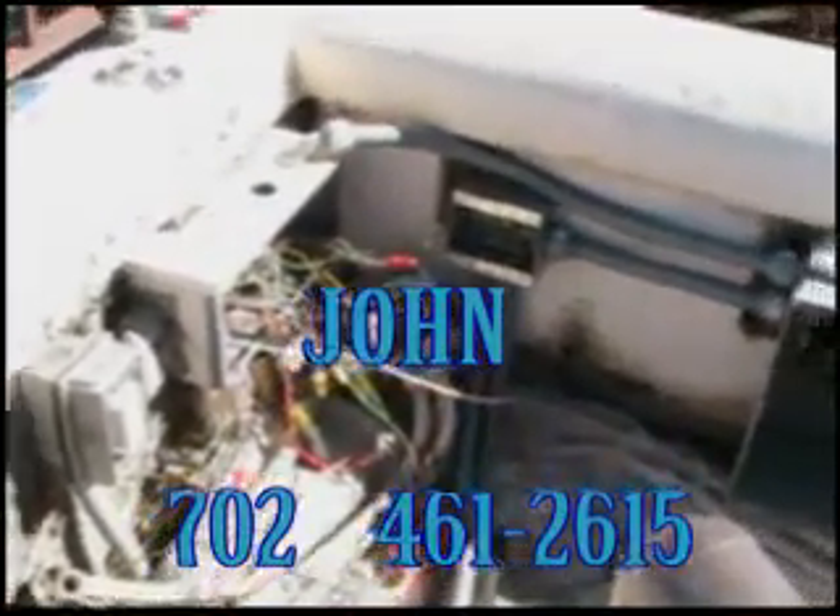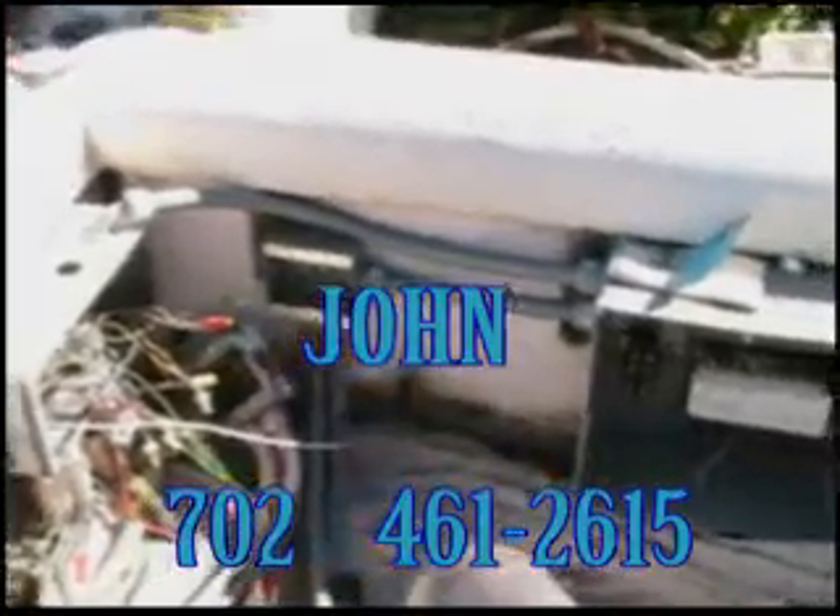There's the J-box with a piece of conduit running on top to the control panel, control panel back to the double switch, switching out to the double 240 volt legs, and then a piece of conduit on the right for the blower. All conduit is run. I am left to rewiring and plugging holes.